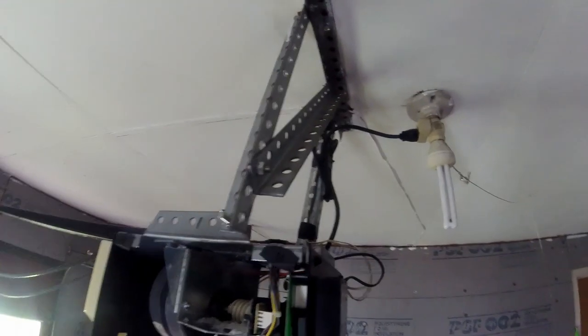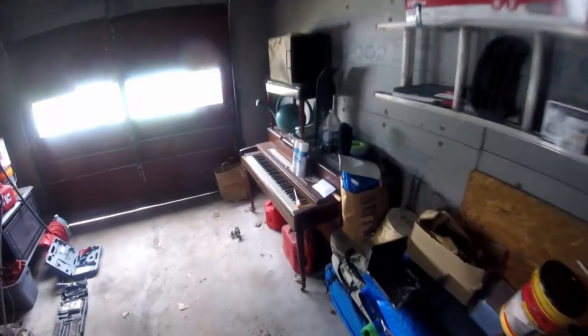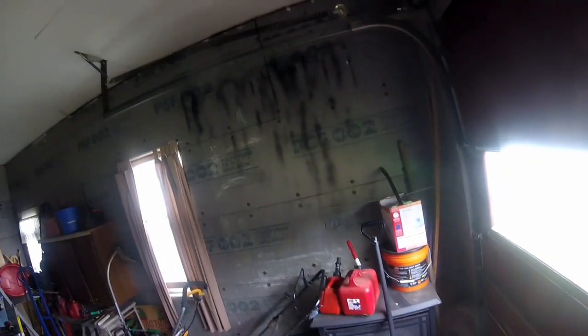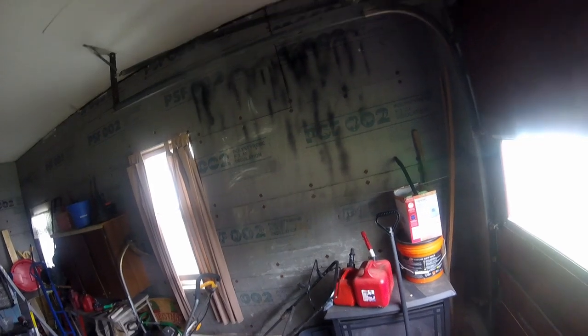Guys, I forgot to film this. I got caught up in doing a repair. There's a little retainer. Let me show it to you over here. Oh, one thing. Make sure you turn the power off before you do this. Shut the circuit breaker off. The little retainer here. This goes this way. The gear faces upward. You pull these two side clips out, then it pulls out.